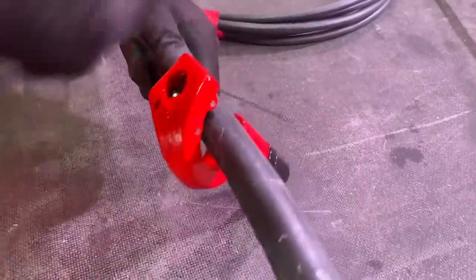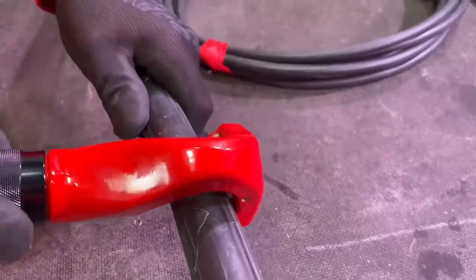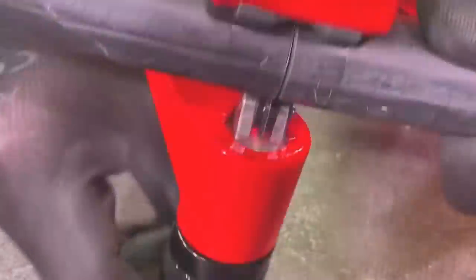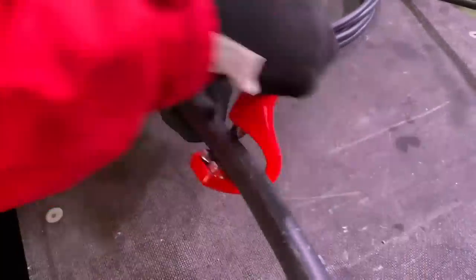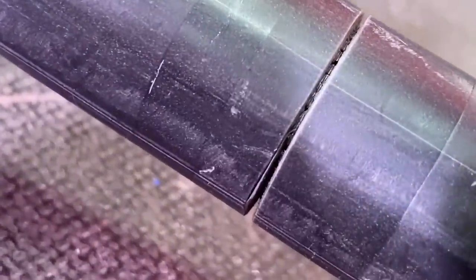So we're going round now, just tightening as you go. You stop and tighten as you go. I try and twist as I go, and it now has a feel — you've got to feel it digging into the actual steel wire armour in order to know they're cutting. It's a different feel from a hacksaw, and a different feel from those hacksaw-based splitting tools as well. You can't hear the cores being cut, so you've got to feel it. You'll notice the actual cut into the armour is incredibly thin compared to a hacksaw-based cutter.